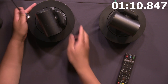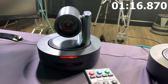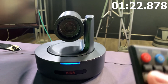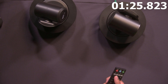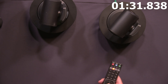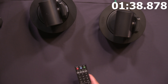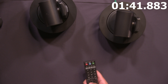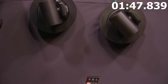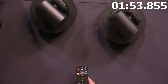If I set it back to cam one and plug this camera back in, it will no longer control this camera. In fact, you will see a red blinker on the tally light indicating that this camera is not the same frequency. So in order to move this camera again, you have to push cam two, and then you'll be able to move it. Same thing goes for the first one — it was set to camera one. So if we use camera two and try to move it, it's going to show that red again. But if we switch to cam one, this one will move only. And that's how you do it.